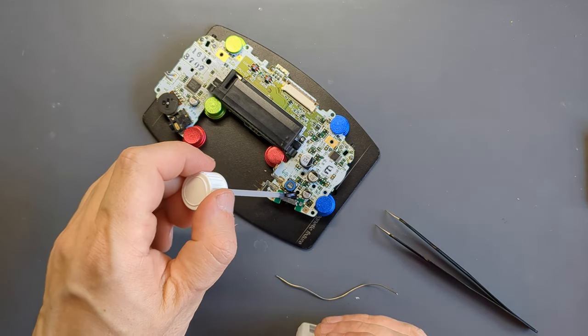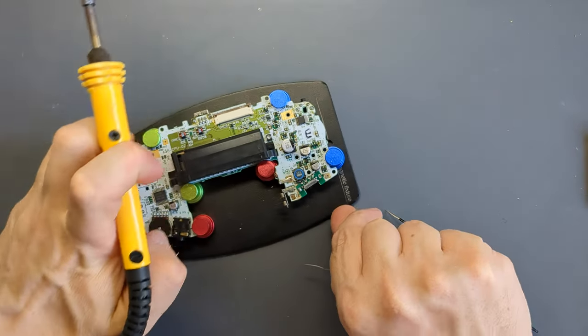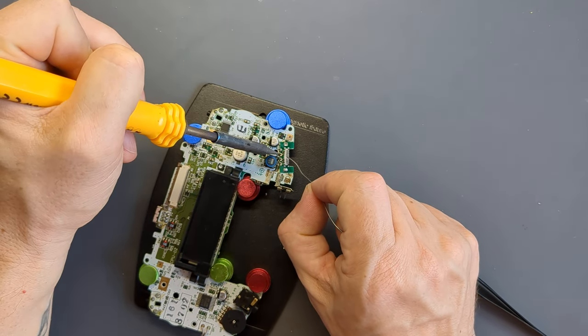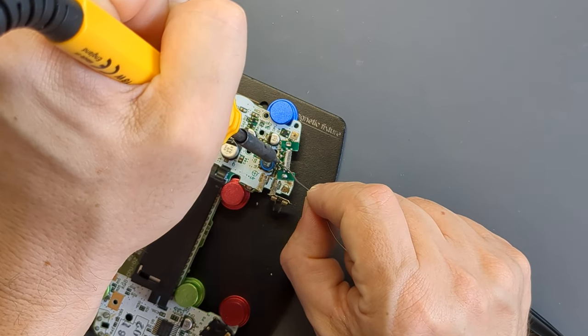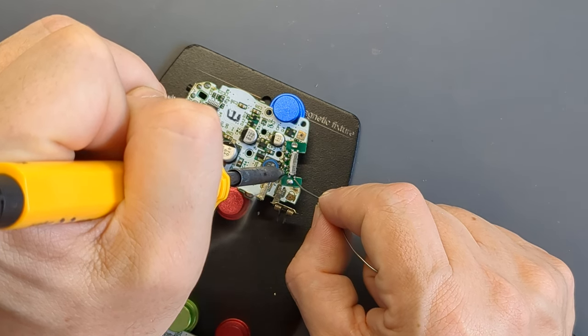The row of four pads is definitely the tricky part, but some careful preparation will make it quite a lot easier. I put plenty of flux across the whole area — this gets the solder to flow to the solder points and prevents it from spreading or bridging across to any other points where you don't want it. I used a very fine point tip on my soldering iron and made sure it was clean, using my tip cleaner and a damp sponge. The tip cleaner is great for removing any deposits from the tip and tinning it with a thin shiny coating of solder. Think about the angle your hands are going to be coming in from and rotate the board to an angle that makes it more comfortable to access those solder points. Have the iron almost vertical so it avoids the other components and is able to make contact with the solder points on the motherboard and the switch PCB at the same time. With the iron in place, adding a little solder at the top, it should melt pretty much instantly and start to flow down towards the motherboard. When you've seen this flow happening, you can move the iron away and repeat these steps on the other three pads.